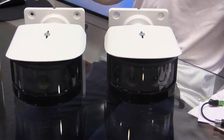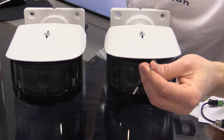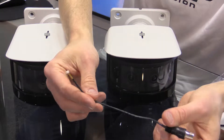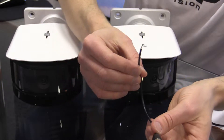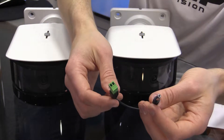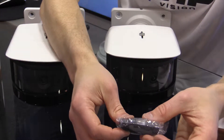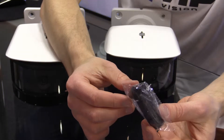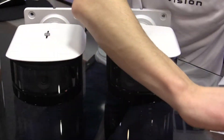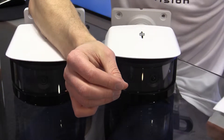Dyna bolts are supplied with the units. We also supply a star security bit screwdriver just for adjusting and setting up the units, an analog out for a test monitor if you're still using one — this just plugs into the base of the unit. There's a power adapter, basically just to split out the DC barrel jack if you're wiring a figure eight or something like that into the product. There's a rubber boot to cover up the RJ45 or cat5/cat6 connector on the unit so that we don't let any water in. It's very important that you fit this. There's a quick start guide, a full user manual on a CD, and some software — Smart PSS and the config tool — for setting up the camera, and the all-important template.